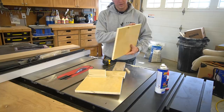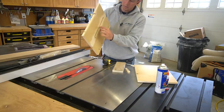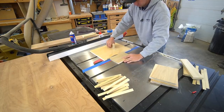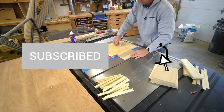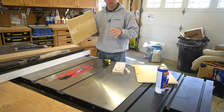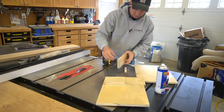To get started, you're just going to want a piece of scrap plywood — this happened to be about 12 inches wide by 16 inches deep. Before we do anything else, go ahead and rip yourself your track guide that will mount on the bottom. Don't go the full length with this because the longer you make it, the more friction you're going to have. Go about nine or ten inches long, and rip it to a little bit less than the actual depth of your guide channel. The reason for that is you don't want it riding on the bottom, getting caught up in sawdust or creating more friction. You really only want it hitting on the sides — so I'm ripping this at about three-eighths wide.